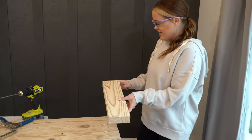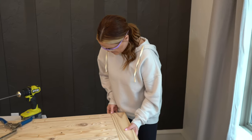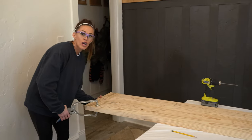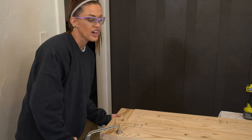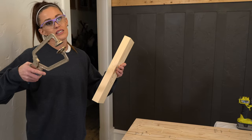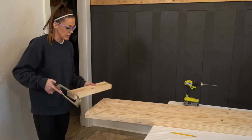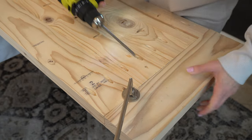I'm going to use my face clamp to get this lined up, and you're not going to use wood glue on this part — just get it lined up with your face clamp. We usually do not use wood glue on our planked tabletops because the glue will not allow the wood to swell and shrink, so it's going to cause cracks. That's why we don't actually have problems with it, especially living in Texas.